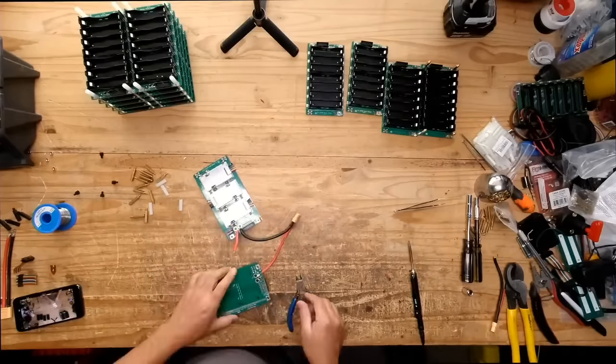So here it is all installed. That switch, I mean the plug. So we just installed the XT60 plugged in there. Now here are the cables. I added a 35 amp fuse here, which is like 1400 watts, so there should never be that much power going through this cable unless there's a problem. So if there's more than 35, that blows, just for safety.